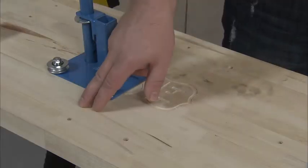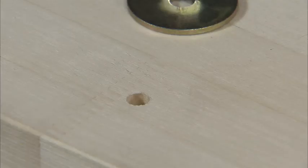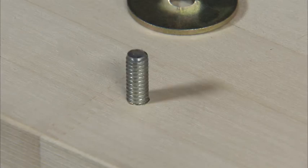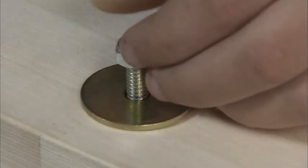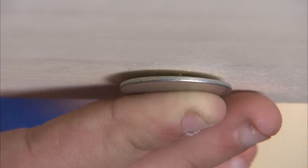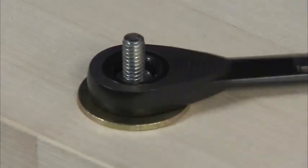The cable pulley is going to involve a little bit of sub-assembly. Start by inserting one of the elevator bolts through the floorboard bottom, then press it through the floorboard. Then place a fender washer on the elevator bolt on top of the floorboard. Now install a quarter inch nut on the bolt and draw it flush with the bottom of the floorboard, then remove the nut.